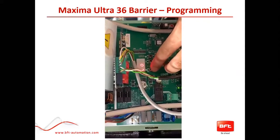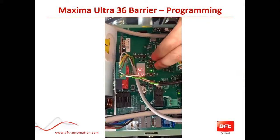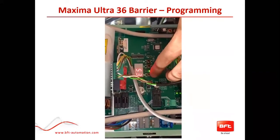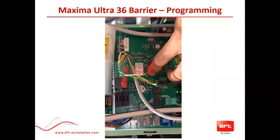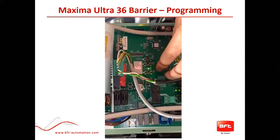If I want to go through my first level programming, you push F to cycle through first level only. When you find what you're looking for, you'll be able to push plus and minus. Once you select what you want, you continue to push F to get on the way out. Once you see ST, it means you've reached the end of your menu and you saved what you just changed.